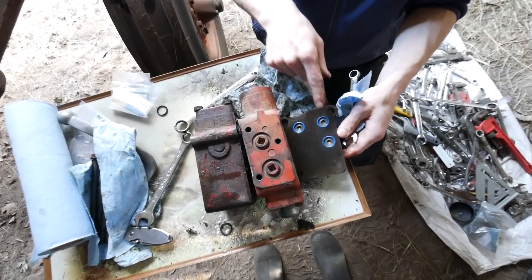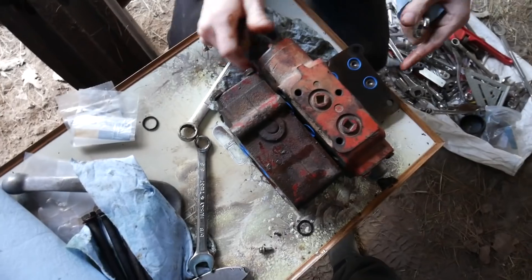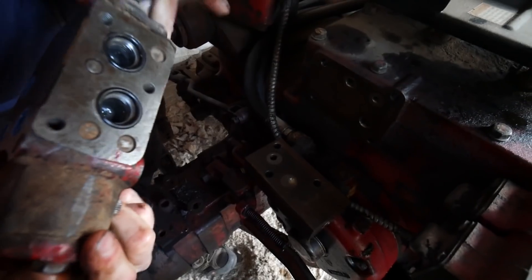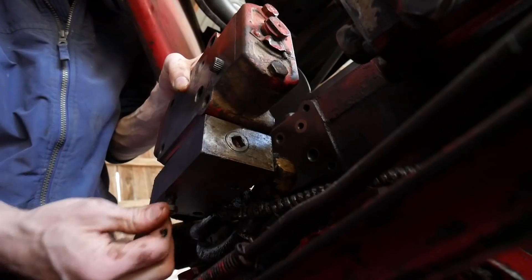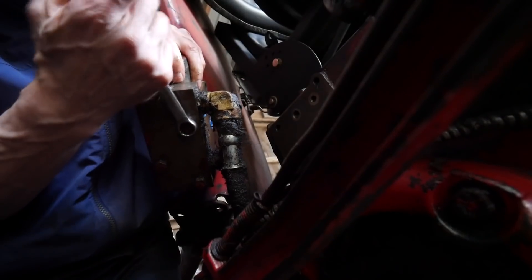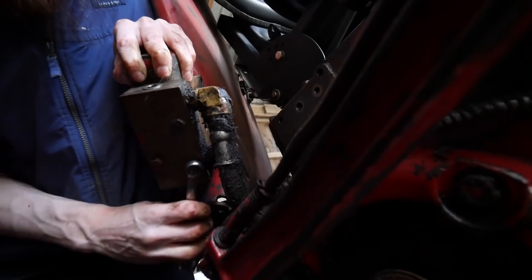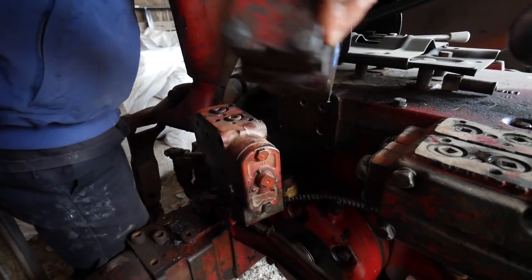They're all cleaned up, the o-rings are in place, and this is how they're going to go - the cover, the control valve, this piece. But before I can put them on together I've got to hook this piece back on to this check valve down here. I've got my o-rings on and there are just three bolts to hold it to the bottom. These are o-rings so this doesn't have to be cranked down tight, just tight enough that they're not going to loosen up from vibration.